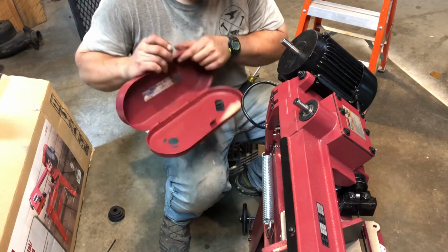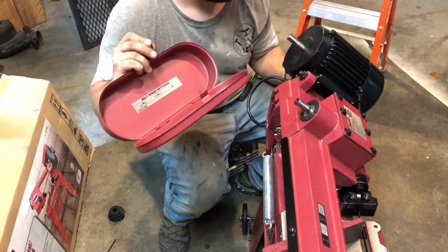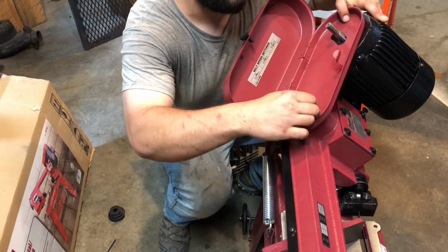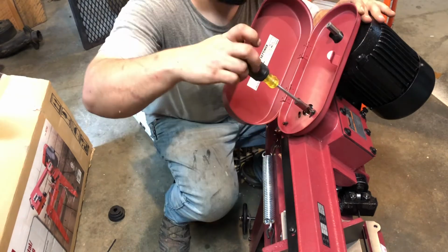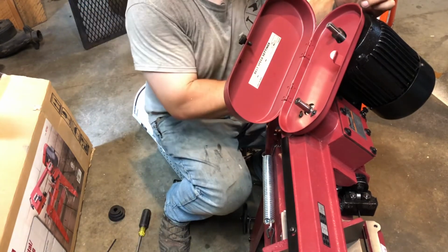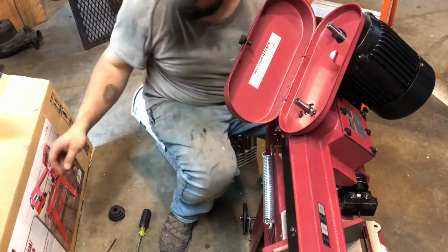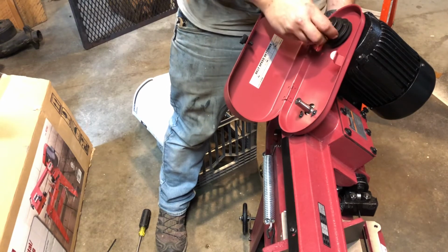And what's gonna happen now is this cover's not gonna fit on here. Oh man, that's way off, the hole's way off. So what you have to do is swing the motor up into its assembled location, and then you take your screws that you took out of the face behind the cover, and you put them back to bed. Nailed it. So now you want to make sure your key is back in its keyway, and if you use your witness mark, you can see where the set screw sat when you took everything apart. By using your eyeballs and looking at the diagram, you can tell which one goes which way. Okay.